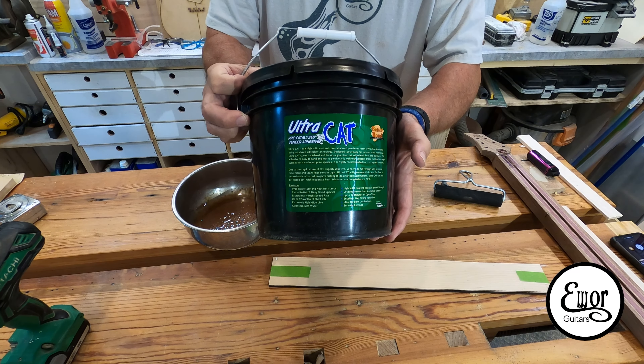Now that it's out of the clamps with the edges and glue cleaned up, I'm getting ready to put it down on the CNC machine for the surfacing path. But before I do that, I want to get a very precise center line marked on each end of that fretboard so I can use it during the other CNC operations. I'm working with my scribe gauge and center line rulers to find a perfect center line marked on the very ends. Once I surface off the top, that line will be gone from the top surface, but I'll still have it on the ends. Then I glue it down on the CNC machine using the double-tape trick, up against my fence, which is a real time saver for getting things lined up correctly.